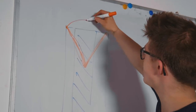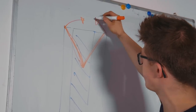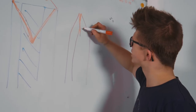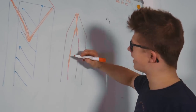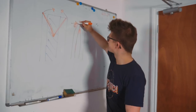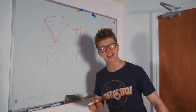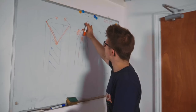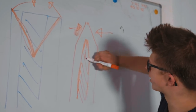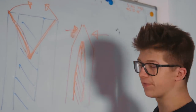I'm then gonna bend these two bits down, forming a point with unwelded material between it, our pattern running down the center like this, and our mono steel terminating at the tip. This then gets forge welded in this direction, and hopefully we can then draw it out, and hopefully it stays together enough for us to forge the sword. That weld will hopefully become invisible, and it'll be beautiful, because we're gonna have our pattern stretched out like this, and our 1055 surrounding the entire edge. It's time to go into the forge.